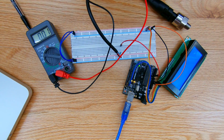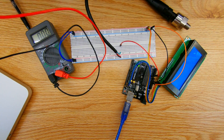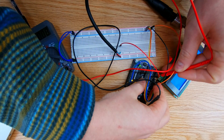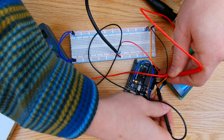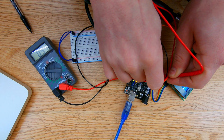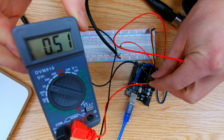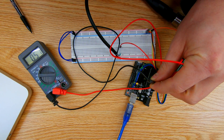To confirm this on the hardware side, I can use a small multimeter. I'll probe between the analog input pin A0 and the ground pin — at 0 PSI with no pressure on the transducer — and that should read about 0.5V. And there it is: 0.5V, which confirms that at 0.5V the pressure transducer is reading zero PSI.